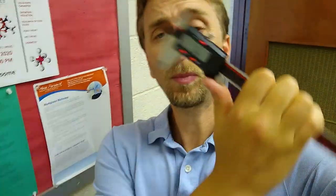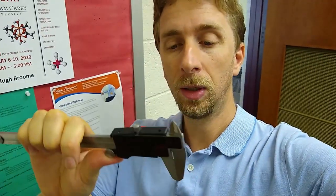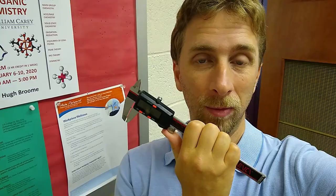Thankfully, modern-day technology has given us a much simpler method with the digital caliper. You just turn it and you see the scales come off right there, and that is much easier — more convenient than having to read the analog scale. When I look at it, it reads to the nearest 0.01 millimeter. This is a millimeter scale, which is important for conversions. The old-fashioned one says plus or minus 0.02 millimeters — not much difference in precision, but much more convenient to just read off the digital scale.